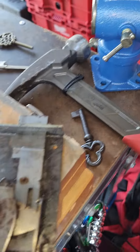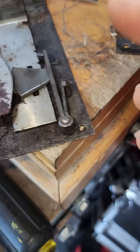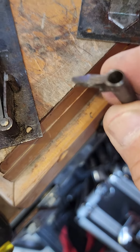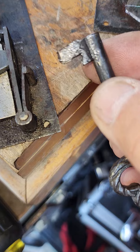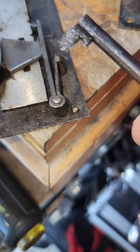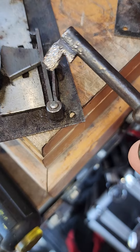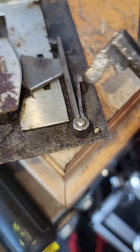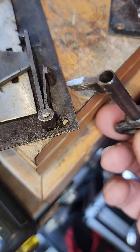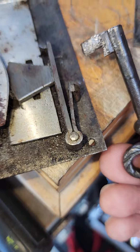Then by taking a vise and a hammer, you actually set this down and you smack it and keep beating it, and it'll stretch the metal. If you don't have a blank, it's hard to order one if you can even find one, so you're gonna have to manufacture your own. In elongating it, you're gonna have to just beat it with a hammer, smash it down, and it actually gets longer.